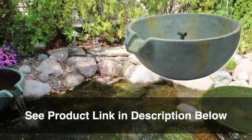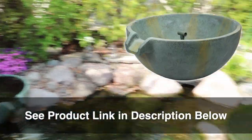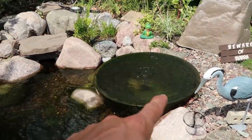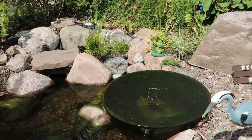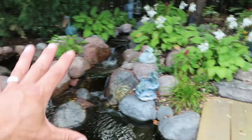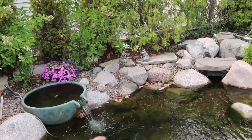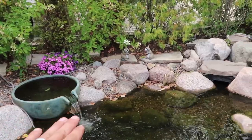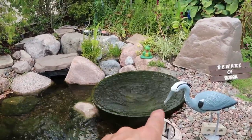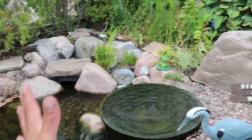You can see the two spillway bowls came back into the water feature. One got sunk into the edge of the pond over there, and then we've got this really cool big bowl that overflows on all sides in this area of the pond. The circulation on this pond is absolutely incredible — you get the push from the waterfalls coming across, the spill bowl over here helping prevent a little dead zone on that side of the pond, and then the agitation of the water here so everything stuck in the corners eventually gets sucked into that skimmer box.